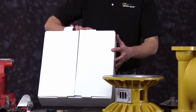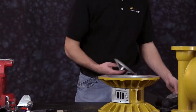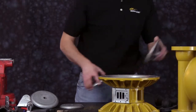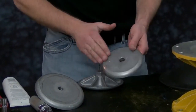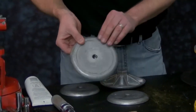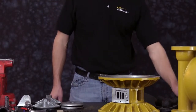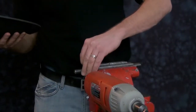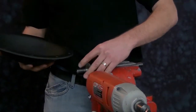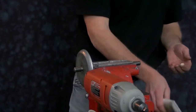Now we're ready to install our wet end kit. Inspect the outer diaphragm plate and the inner diaphragm plate for any sharp edges. You can clean up these edges with an emery cloth or a crocus cloth. Clamp the main diaphragm rod into the vise with the set of aluminum soft jaws. First install the plastic washer, then the inner diaphragm plate. Before installing the diaphragm, apply a little grease to the touch points on the inner diaphragm plate to ensure that we don't get a false torque in our diaphragm assembly.